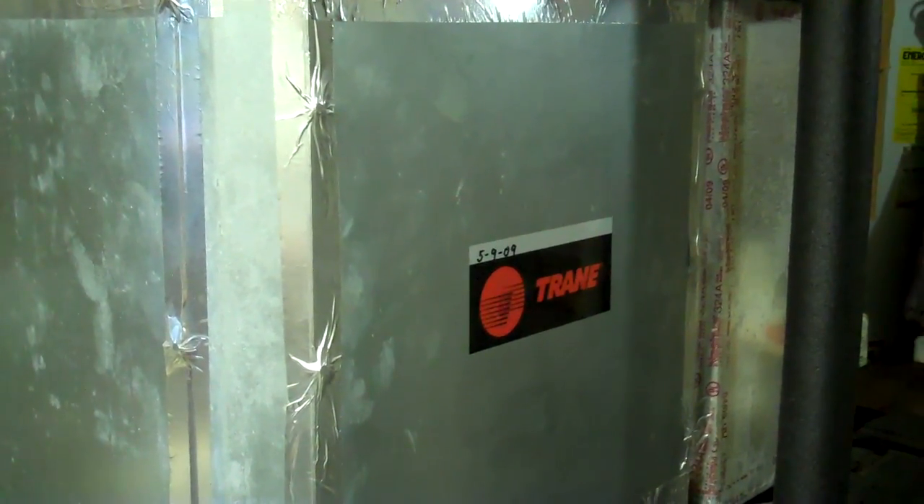The main way I heat my water is with the geothermal heat pump. I do have a dedicated video to that — just go to my channel and look for it. But basically it takes the heat off the compressor and the hot line and circulates it through the water heater. A bunch of those insulated lines are going back there. It does all my water heating when I'm on the grid.